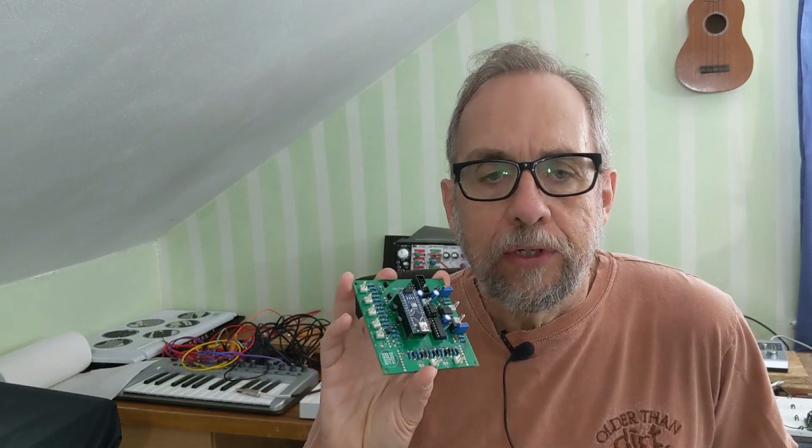synthesizer circuit. So let's say you have an idea for a module you'd like, something that takes a control voltage or 2 or 3 or 4 control voltages and a gate or 2 or 3 or 4, and there's some controls on the front panel, and from all of these it creates an output control voltage or 2 and an output gate or 2. And maybe you can come up with some circuit that does that transformation from the inputs and controls to the outputs.